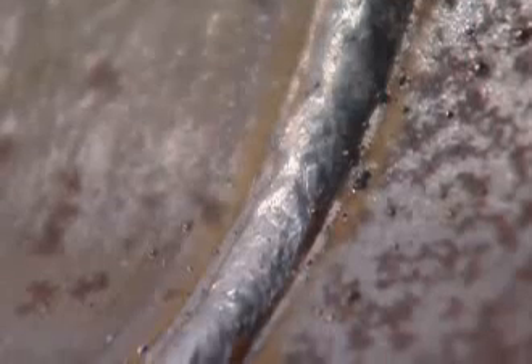If the wire is positioned on the leading edge of the puddle, similar to traditional short arc technique, the wire will push through the joint. The arc will stutter and sound like this. The resulting weld will have greater penetration and some spatter will be produced inside the pipe.